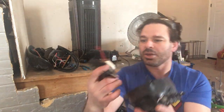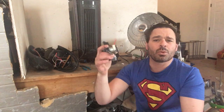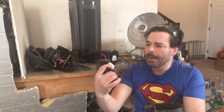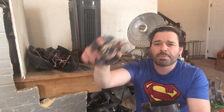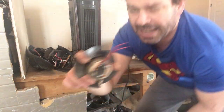Here in the back you can see a nice small copper motor — there is some number two copper that I'm going to remove out of this motor. You do want to check it; you want to scratch it with a file. If you scratch that copper and it reveals a metallic look underneath, it's going to be aluminum. A lot of your newer items like vacuum cleaners — manufacturers are starting to replace the copper wire with aluminum wire. So if it is aluminum wire, I'm going to leave it as is and just get motor price, which is about 10 to 15 cents. But if this is copper, I'm going to take it off — separate it, because $4.43 a pound for number two copper all adds up.